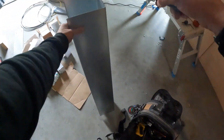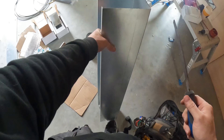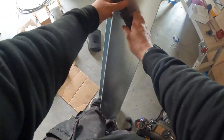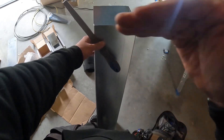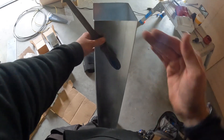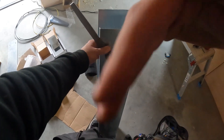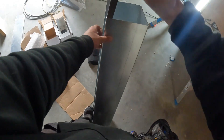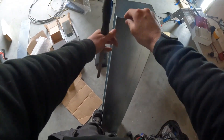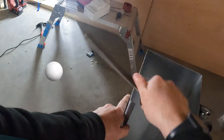So there we go - not too bad that. Time for the file then, get rid of your swarf - your little sharp bit. If you want it super smooth you kind of take the edge - imagine your edge like that - and basically start rounding off that sharp 90-degree edge. Round off the sides, go to the top, round off all the way around, and then it'll end up really smooth. Super light - literally just fingertip pressure.